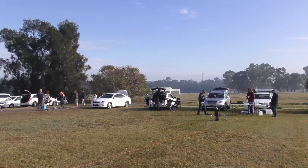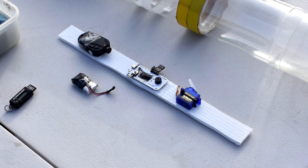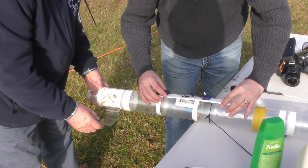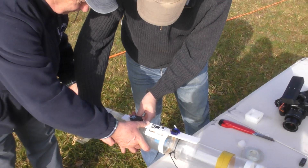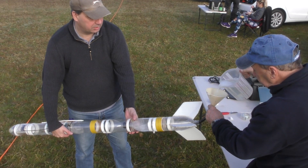So we took it out to the launch site. Before testing it with the actual parachute we first wanted to see how it behaved in flight. We attached it to a short strip of Corflute and attached a separate servo motor and a camera as well. We lined up the camera so that it could see the flight computer, the servo motor, as well as the horizon. This way we would know what the flight computer was doing in relation to the rocket's position in the world.